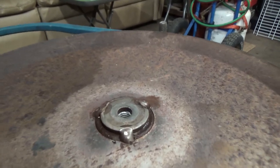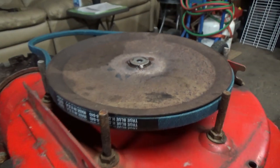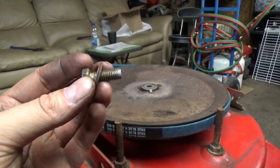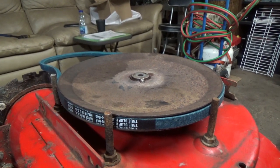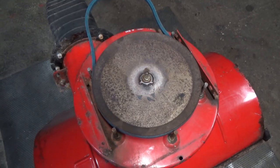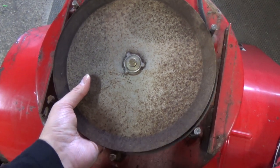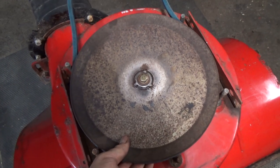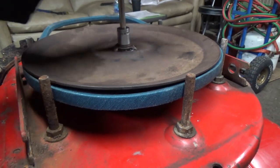You want to make sure that your pulley is bottomed out as far as it can be — you guys can see the crankshaft right underneath that welded washer there, so it is bottomed out. We're going to take our bolt with a washer and put this in, tighten that up, and this thing is ready to bolt back onto the rear housing. Before we put everything back together, let's get a quick before: you guys can see it can go forward and back, so this bearing's been gone for quite a while. And now an after — I'm pulling up on it, there's no end play, no side to side, and when we spin this using a ratchet it spins nice and freely. That's perfect.